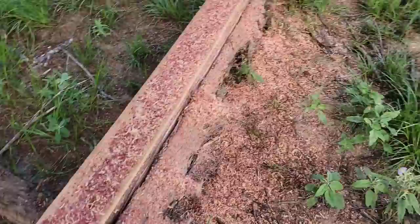I think this is going to work. Once this is done I'll take it over to the sawmill. I've got a little Craftsman bandsaw that will do a six inch cut. Once I have a flat edge, I'll be able to put it down on my rollers and roll it through the bandsaw and cut the other four sides square. Totally freehand — my logs were too twisty. I get one side flat and the other side not, but this appears to be working out best for me.